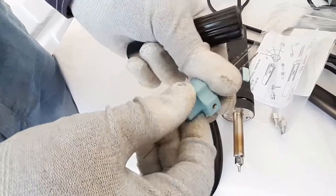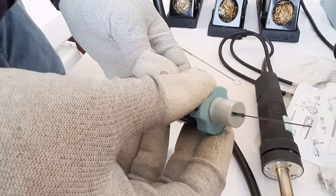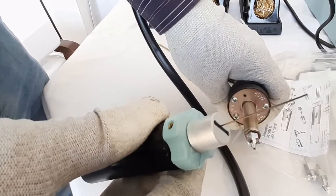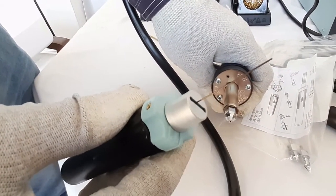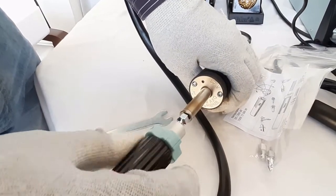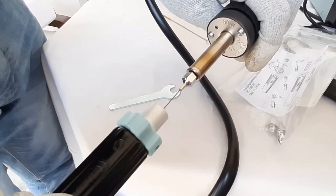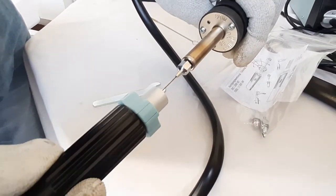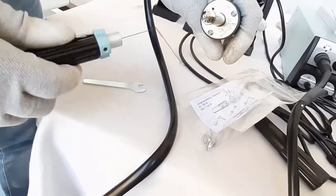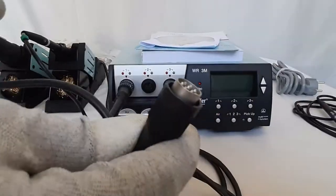Select the appropriate pin and fix the aluminium cap back onto the cleaning tool. It is mandatory to fix this cap because without it the cleaning tool may burn when touched with an extremely hot nozzle. The cleaning pin should be inserted into the nozzle in hot condition, not cold condition. We can also use other cleaning pins matching the nozzle size.